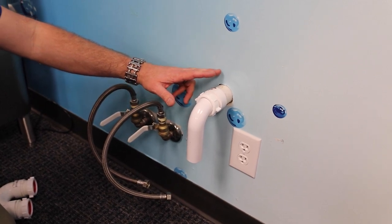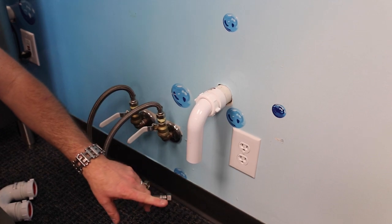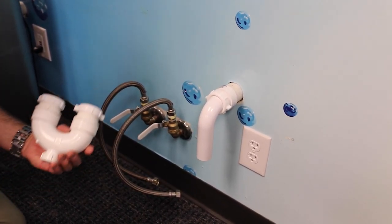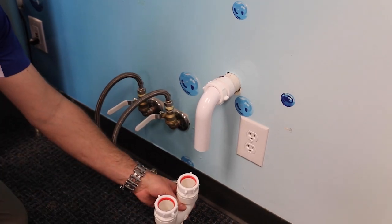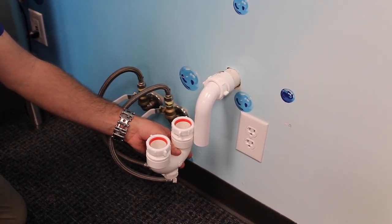So with wall draining systems, we want to make sure that the tube is cut the same level as the tube that comes out the bottom of our system. Once you have those even, we will then bring in our trap adapter and we will hang the system, and when the system is finally hung, we will come in from underneath and we will slide the trap adapter up and tighten down the nuts.